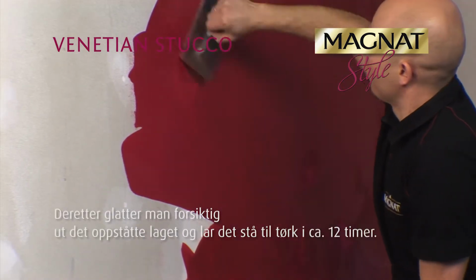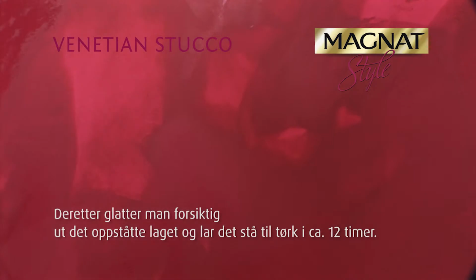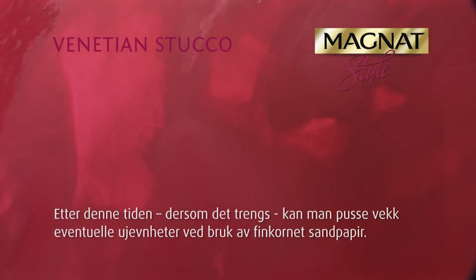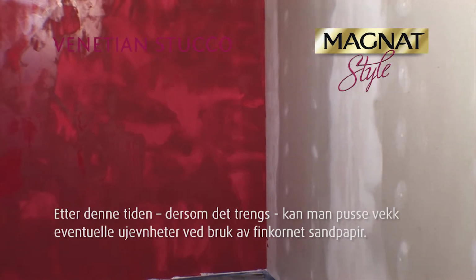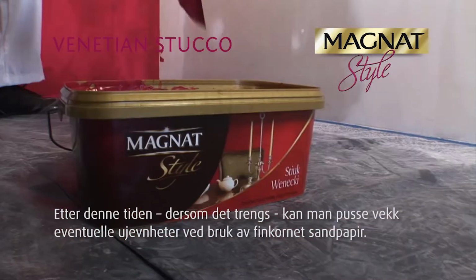Next, gently smooth the coat and leave it for about 12 hours to dry. After that time, you may sand down small irregularities with fine sandpaper if necessary.